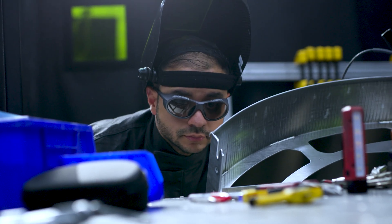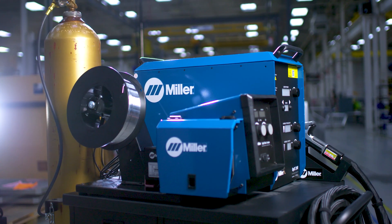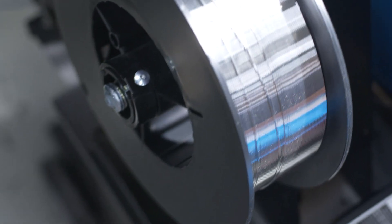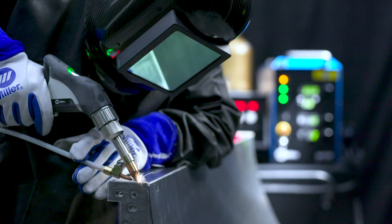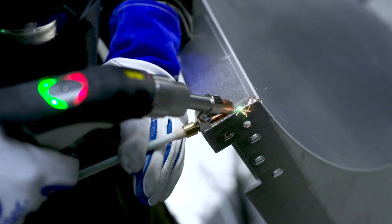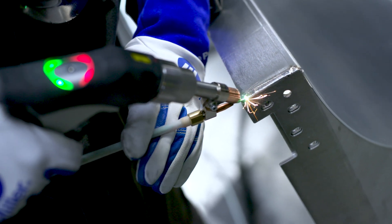The parts are more complicated, but as far as the welding process it's actually simpler. It's melting in the process, but the wire helps push your travel speed so it controls it — you can be more consistent. It's a lot easier for a non-skilled welder compared to someone doing TIG, which takes months or years to learn.